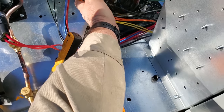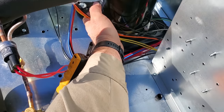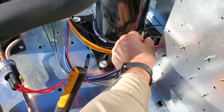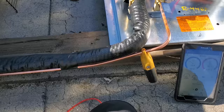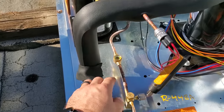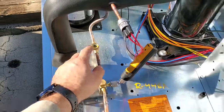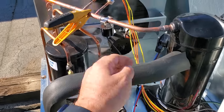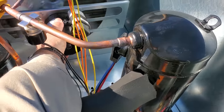Sometimes on these small ones you've got to wrap the wire around the clamp, but they didn't give me enough room there to measure it. Sight glass is clear. The only thing I'm a little concerned about on this startup is that condenser fan motor slightly overamping. That is a weird motor — it's kind of warm.